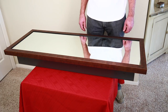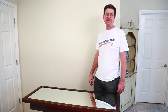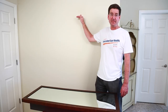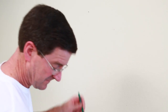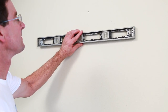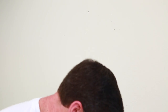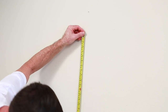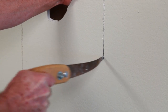Figure out what height you want the top edge of the mirror at, then subtract 3.25 inches to establish your top cut line for the vault. For this install, since I'm 6'3", I chose the height to be 75 inches from the floor to the top edge of the frame. After marking the inside edges of the studs with the stud finder, using a level, draw a horizontal line at the desired height between the two studs. Measuring down 43.5 inches, draw the bottom horizontal line. With the lines marked out, I'm ready to start cutting with the drywall saw.